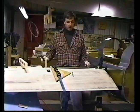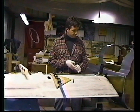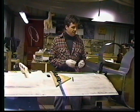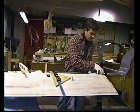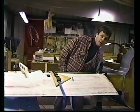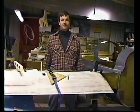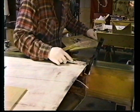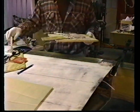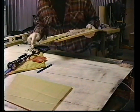At this stage, we're now going to mix a massive batch of Bondo with flox without hardening it. Get it mixed well to a consistency that'll hold its shape. And then we're going to add the catalyst to it and bond it here, here, bottom in the same place. We're going to put a blob between the two spars here at the bottom inboard. Can you hear me okay, Tim? Mm-hmm. All right, ready to bond. Okay. You can use pieces of wood across this if you want, but I just use big blobs of Bondo mixed with flox because of its fiber strength.